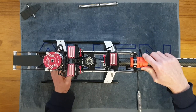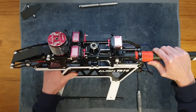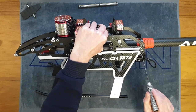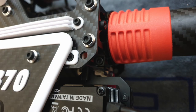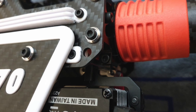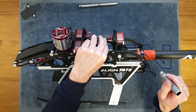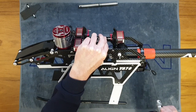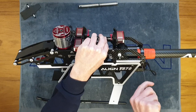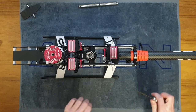Check that everything's still in the forward position with the belt on our pulley at the end. Coming around to this side, you'll see a hole in the frames that lines up with the bolt that clamps the clamp here onto the plastic sleeve. With everything in the forward position and the clamp up against the shoulder of this plastic, go ahead and tighten that bolt.